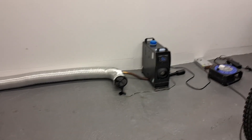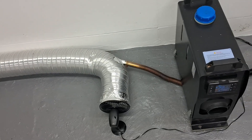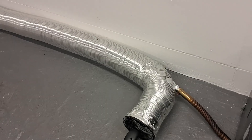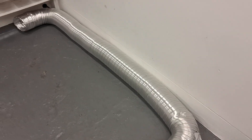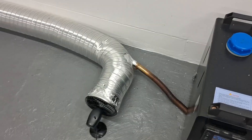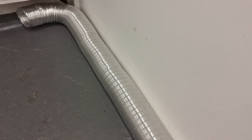I've got the heater running on the lowest setting, setting 1, which is quite adequate to heat up my double garage. The exhaust pipe is a 1 inch flexible tube with a 1.8 meter extension piece on it, going through a hole in this 5 inch aluminium ducting. This piece is a 3 meter long length and the exhaust pipe is acting as a heating element within it, with the fan blowing all the warm air being heated up by the exhaust pipe within the aluminium ducting.